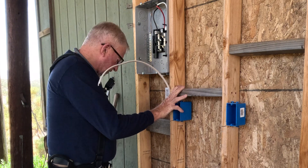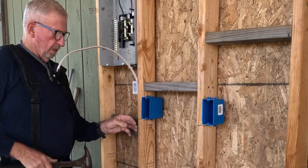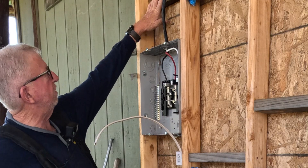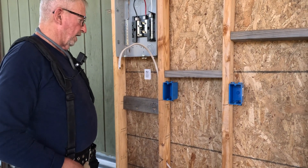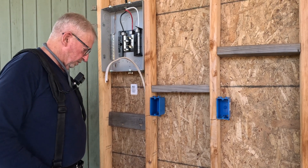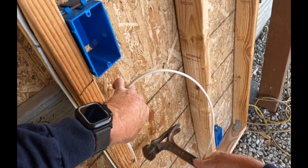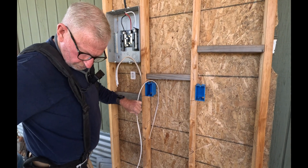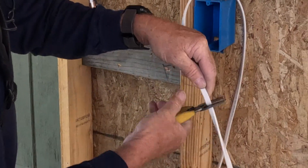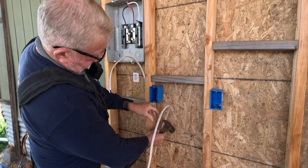Within 12 inches of the box you have to install a staple. Another thing I like to do is put blocks in when you're doing a room addition — if you have multiple circuits you can use that, but today we're just doing the one circuit. Keep your wire nice and neat, don't hit it too hard. Now I'm coming up to my switch, and you have to have a staple within 12 inches of the box.